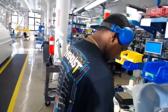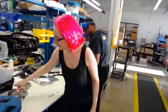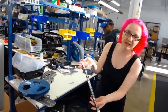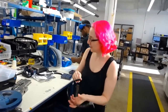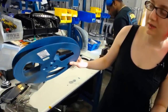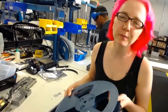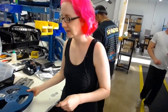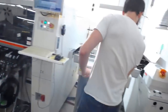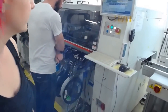There's a feeder that's all set up and ready to go. This one just finished up — this is like the end of the feeders. You have a little bit of tape left over, but when the feeder is empty you have to get another reel. Each reel holds about 500 components, so if you're making a lot you have to change them out every once in a while. Now the pick-and-place is happy again and it's wrapping up this board — in a second it's gonna pop out of here.